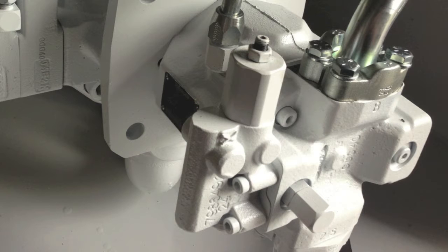For example, in your system we have installed a Sun RPEC LWN relief valve to protect the clamp pressure portion of your circuit. Note that this relief valve has been set at 1700 psi, or 200 psi higher than the pump. This is to ensure that the relief valve doesn't attempt to open or relieve at your intended pump pressure setting of 1500 psi. Any adjustments made to the DR compensator must take into consideration that additional adjustments to the relief valve may be required to avoid unintended consequences such as pump instability, motor overloading, excessive heat, or even pump failure.